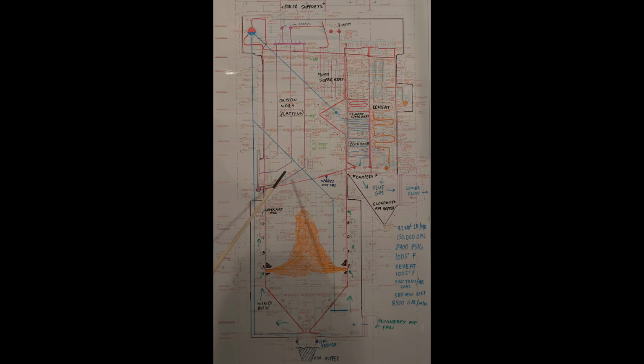You can see that. Up here, the slag buildup appears as white spots. The slag's pretty much white hot. Finishing superheaters, it will bridge across these and start plugging up the boiler pass. You have different soot blowers. These try and knock the slag off.